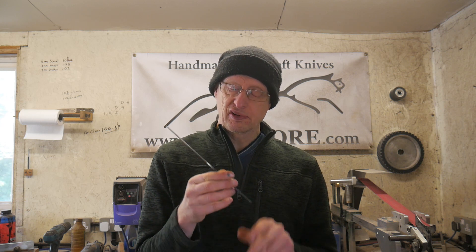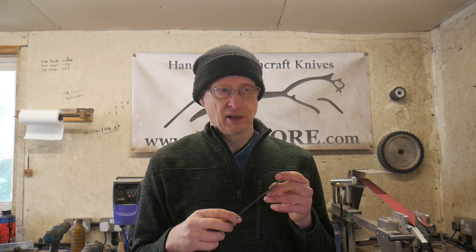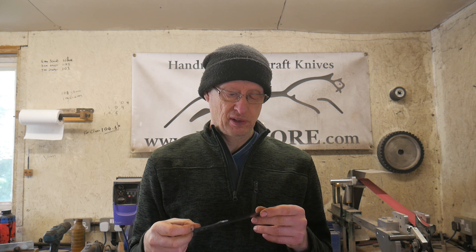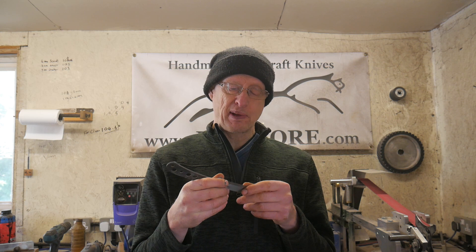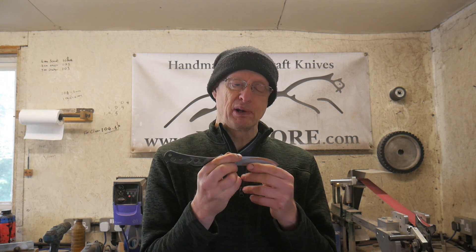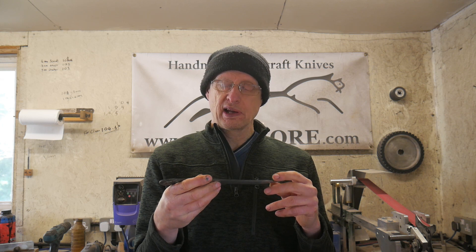So I've got here a working heat treat. I'm sure that if this knife was used sensibly it wouldn't fail. I still feel that the hardness for this steel to perform — for the edge to flex and return — needs to be about 59 to 59.5 HRC. At 60 HRC they were chippy. Below 60 HRC they were flexing. That's heat treat number two.